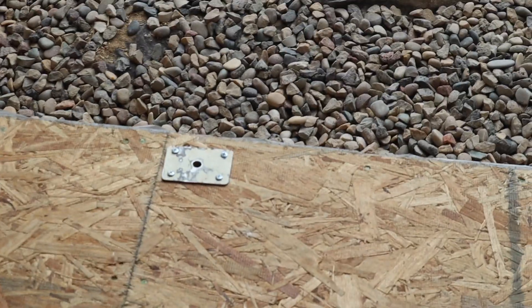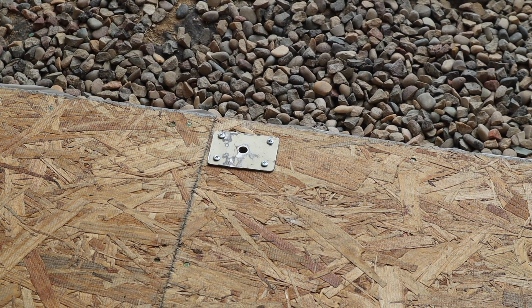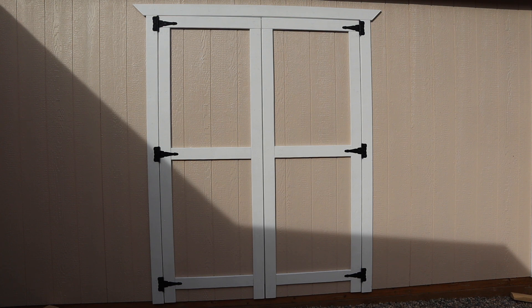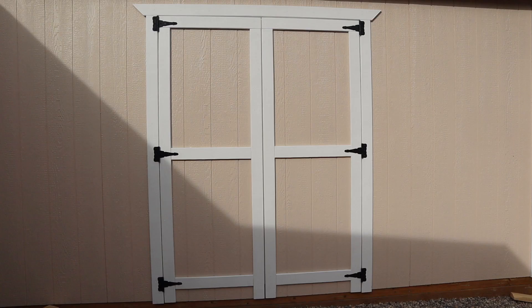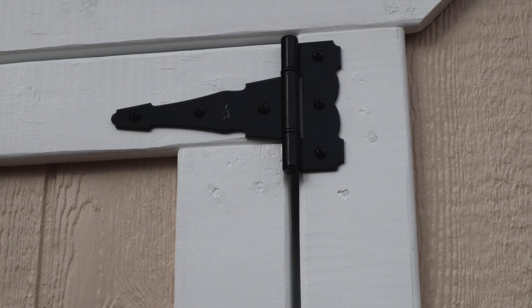At the bottom and the top I fabricated a bracket from about one-eighth inch steel plate for the pin to go through into the floor, which gives a good solid fixture for that locking pin. That's how I made the DIY barn doors for my new shed. In my next video I'll show you how I'm going to make a locking bar from scratch using scrap metal instead of a door latch. Thanks for watching and we'll see you on the next video.